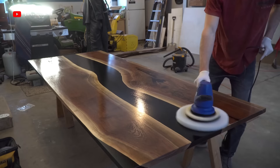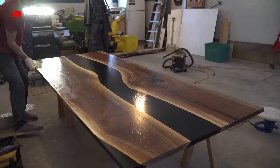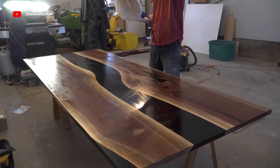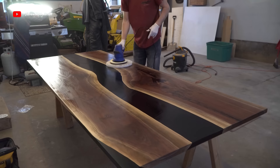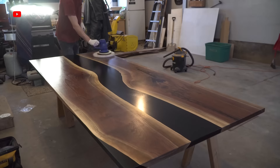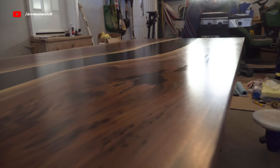This is a $50 car buffer I got — I just put some velcro tape on the bottom to hold on the pad and it works just fine. I put links to products like these 3M floor buffing pads in the description below; if you're going to buy them please use the link — I get a small percentage and it doesn't cost you any more and it helps me make more videos. Here I'm just using a microfiber towel to buff in some of the sides. The secret to this finish is once you have it buffed in and let it sit for about five minutes, you can flip over the pad and buff off all the remaining Osmo. I then check the sheen at a low angle to make sure there's no uneven spots or blemishes.